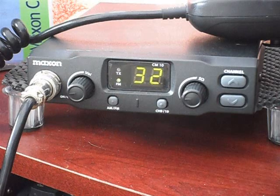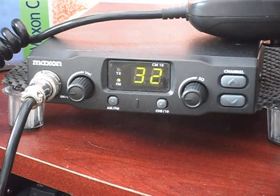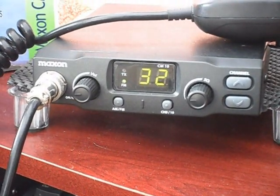Code 6 is CEPT, the mid-band FM — 40 channels FM at 4 watts. Code 7 is the UK channels — 40 UK plus 40 mid-block on FM. Channel selection number 8 is Poland, which is 40 channels AM and FM with 4 watts and the minus 5 kHz offset, which is quite a novelty.